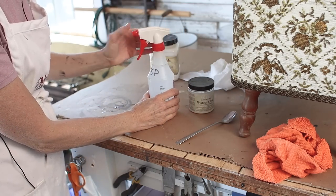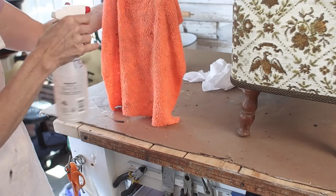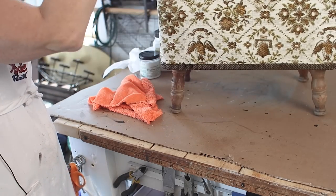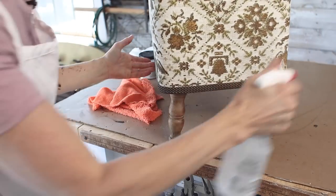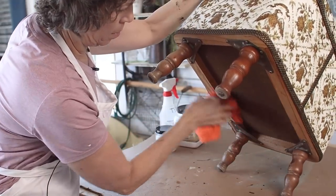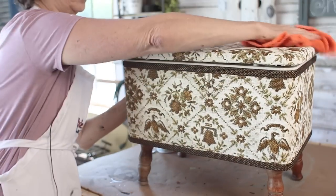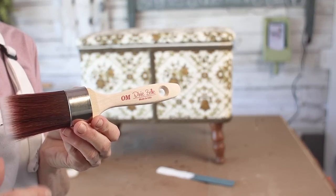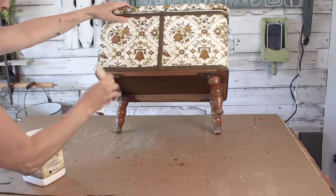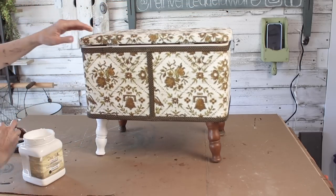I set the jar off to the side to work on its own, and in the meantime I'm going to start working on this adorable little craft cabinet. It needs to be cleaned — we found it at an auction, it was outdoors. Any piece you work on, you've got to clean it first. One of the cleaners I love best is from Dixie Belle called Pristine Clean — it's a TSP alternative cleaner. They also have one called White Lightning and they work pretty much the same. Mix a very little bit in water, put it in a spray bottle, and wipe it down with a microfiber cloth. Then rinse out the cloth well and wipe it down again to remove any TSP residue.